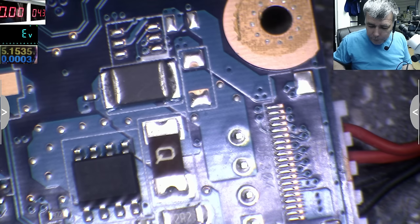You have. After that is going the resistor. After the resistor, do we have 19? We have 19.2. After that, we have the fuse. Do we have 19? We have 19. After the fuse, we have 19. We do have 19. And the track is going to this MOSFET. Do we have 19? Yes, we have 19.